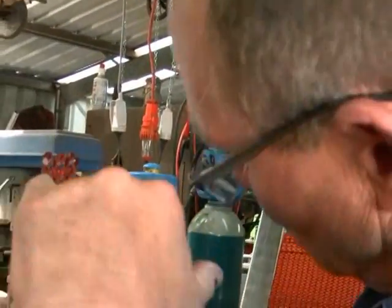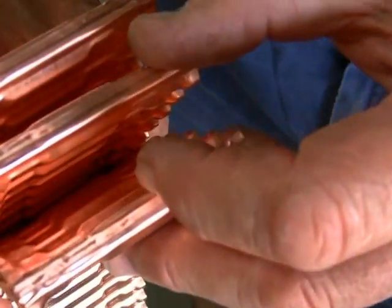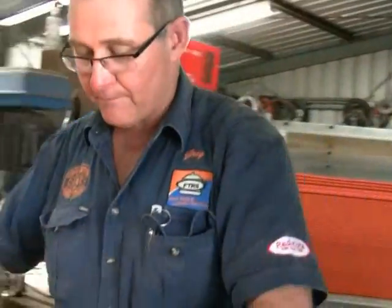What you're looking at that way is the air side of the radiator. That's the air side, and that's the water side. The air goes through there — that's what we recognise at the front of the car. The water actually runs down between the tubes through here. The top tank fits on there. So what we've done there is created some honeycomb core.